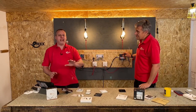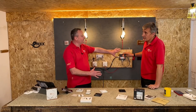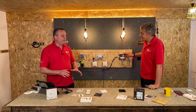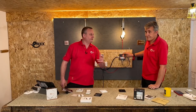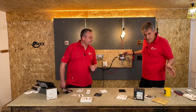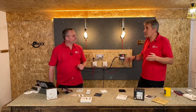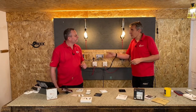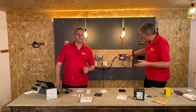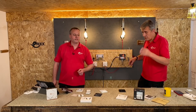So that's sort of the first flavour - the original version, that radio frequency signal being picked up by a receiver that's simply paired. But we also hinted there was a Bluetooth version. That brings in another degree of control because you can use an app on a phone. However, it also makes it easier to commission, because here we were juggling multiple presses of switches in different orders, and we had to get inside to press a triggering button to get into setup mode.